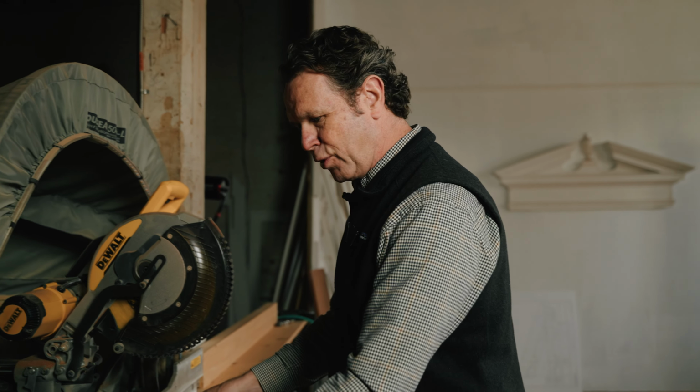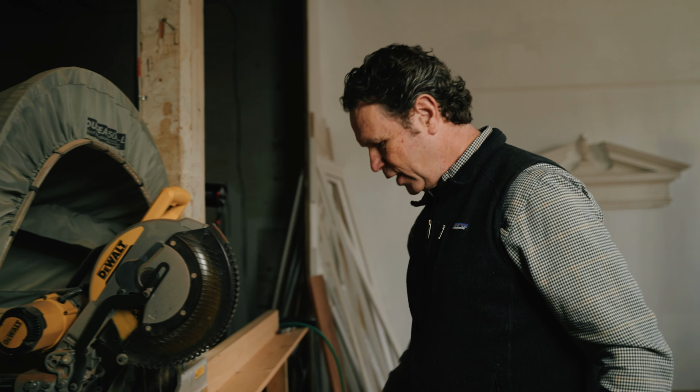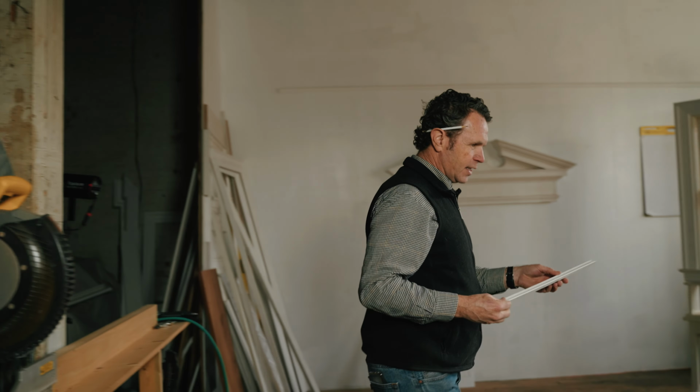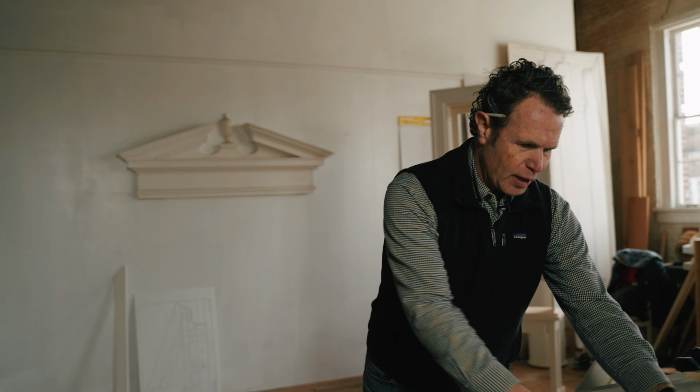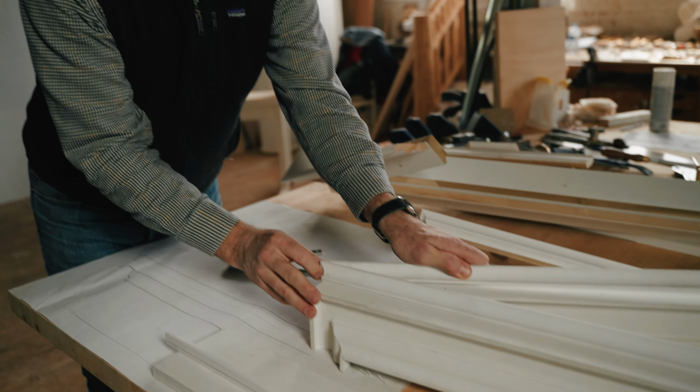I've got it at 22.5. And so that way you're just putting a block on your chop saw. You've already got the angle, so this stays at zero. And then you bring your molding in here and cut your degree. Then when this comes together, when I'm trying to miter these together, that's the way I get that really crazy angled cut there, by cutting it that way.